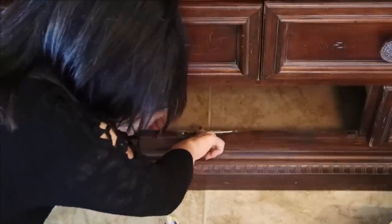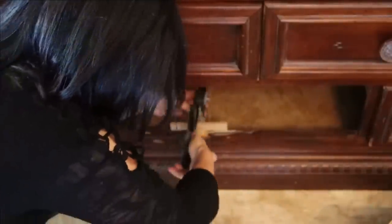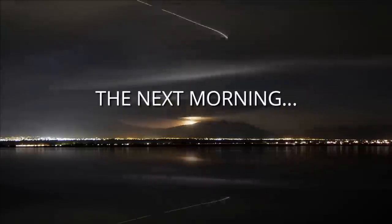this drawer. So once we put on a little wood glue, I spread that cracked wood open a little bit and push it down with my finger, and then I take a clamp and clamp it into place. And that piece of wood that I'm putting behind it is there just to distribute the pressure evenly along the cracked area, and then I let it dry.